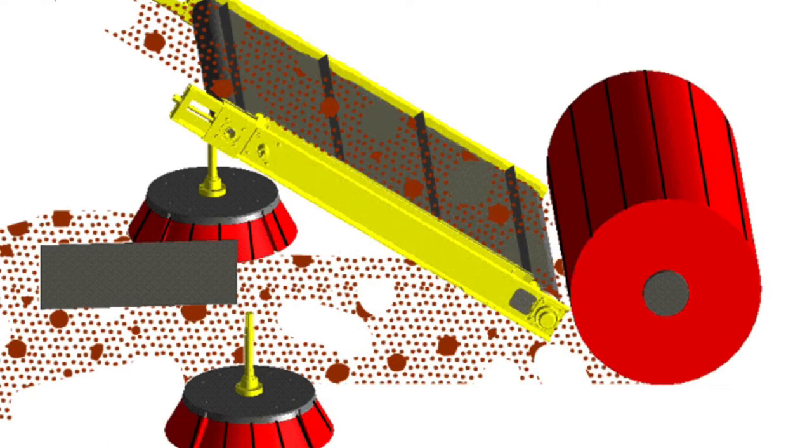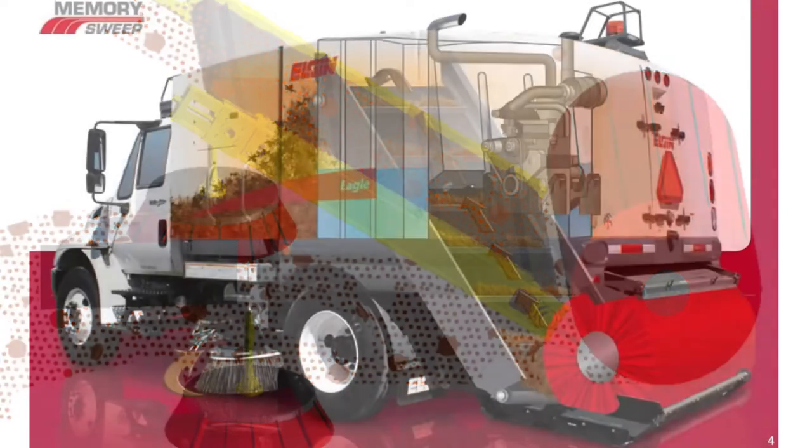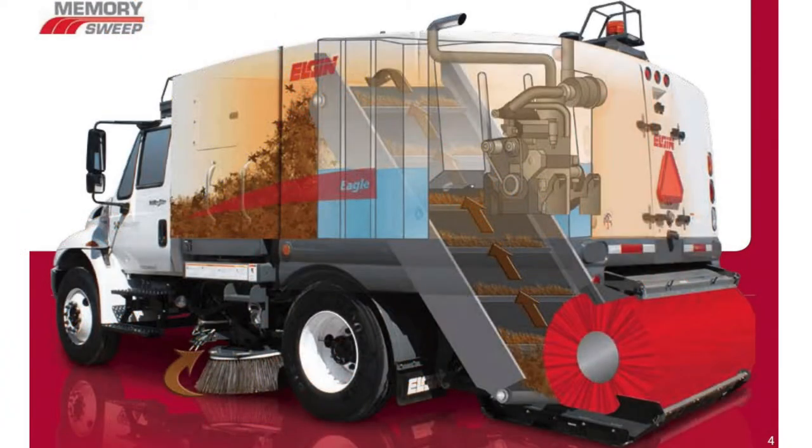The principles of operation. Debris is collected and diverted under the vehicle. As the vehicle passes over, the rear main broom diverts the material onto the conveyor, which deposits it in the hopper. Water is introduced to minimize dust.